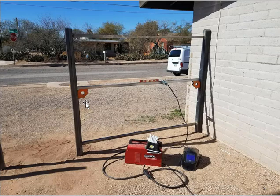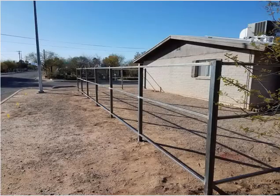So all in all, I recommend those big magnets there holding it in place. Those are very handy, and they hold a tremendous amount of weight. I didn't have any problems holding even fairly long runs of the 1.5 by 1.5 14 gauge metal. Get it up there, get it level, tack weld it in, and go to town. So this is just rinse, lather, repeat. Nothing too terribly technical there. And when you're done, it kind of looks like a cattle pen.